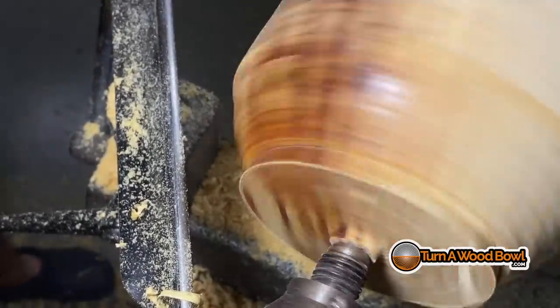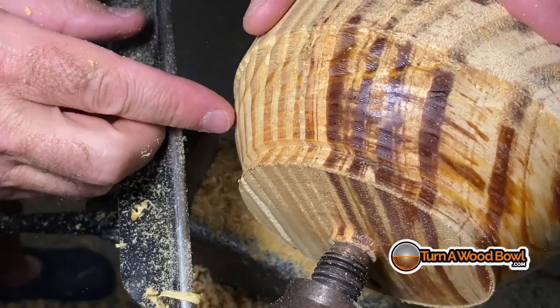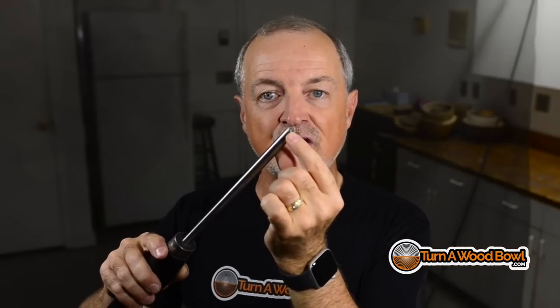If you're floating the bevel, that's what you want. If you go backwards so that the heel — the bottom part of the bevel — is being pushed into the wood, what's happening is you're rubbing the heel. If you do it severely, the cutting edge will come out of the cut — you'll go from whatever depth you're at to thinner and thinner until the tip just pops out. That's a good indication that you're rubbing the bottom of the bevel or the heel.